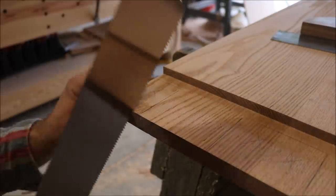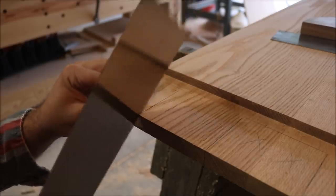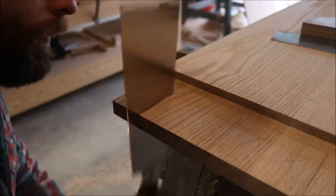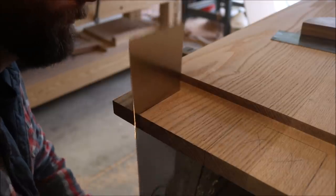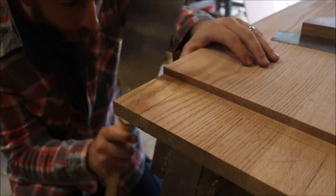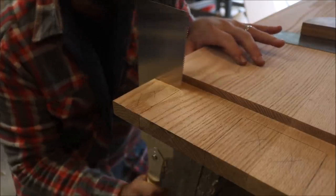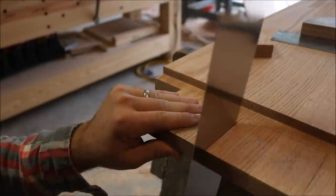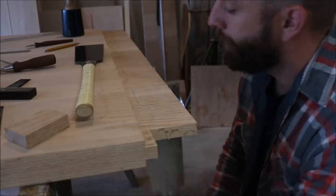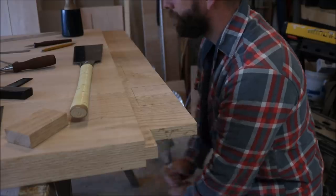Next, I marked out all of my tenons. They're going to be four inches wide and there are five total - one for each of the boards I used to laminate the top together. I am also not cutting the tenons all the way to the shoulder. I leave three-quarters of an inch, which will serve as the tongue and groove, also sometimes called a haunched tenon. This gives the breadboard end an incredible amount of strength and support, and also prevents the tabletop from ever wanting to warp. The reason I'm going three-quarters of an inch for the tongue and groove is because that's the max depth of my plow plane.